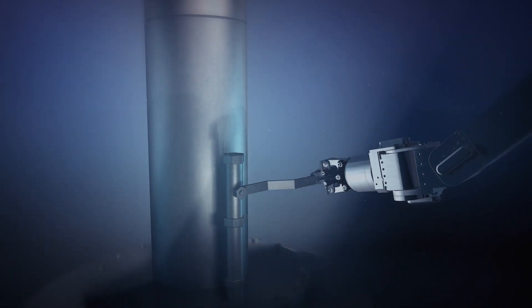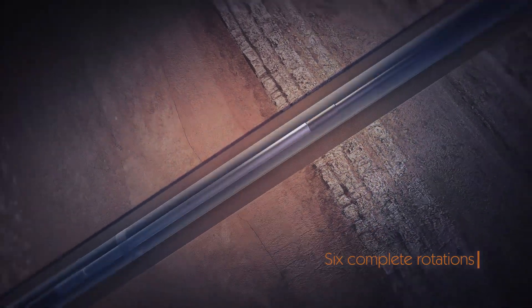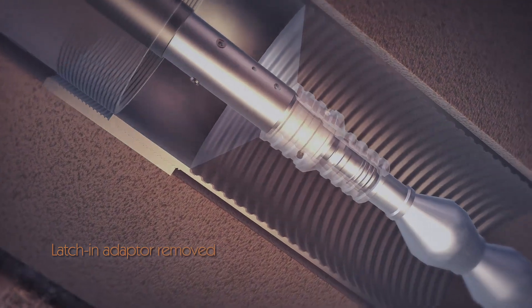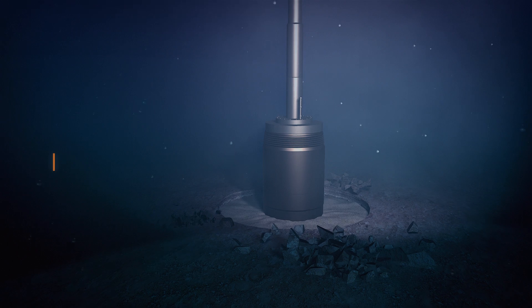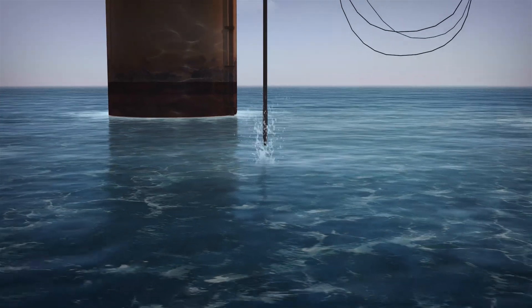Circulation can continue for as long as necessary until the inner string can be recovered. As the C-Cure tool is still in free rotate, the running tool can be safely disengaged before picking up and stroking the C-Cure tool into torque through position, now able to unlatch from the receiver before pulling out of hole — ready to go drilling straight out of the PDC drillable shoe with no cement plugs or shoe track to damage the BHA or dull the bit, and the casing test already completed.